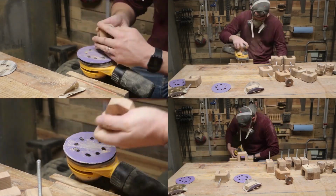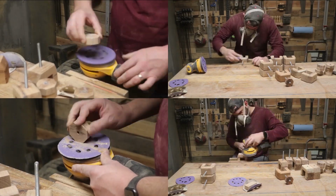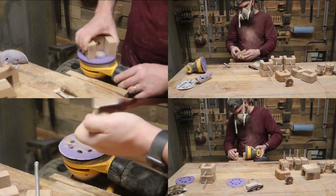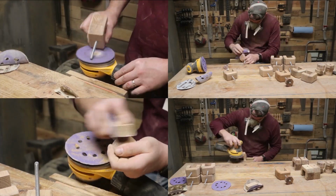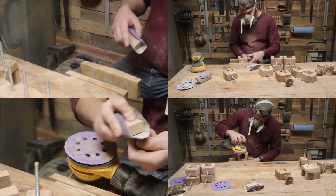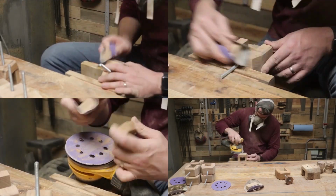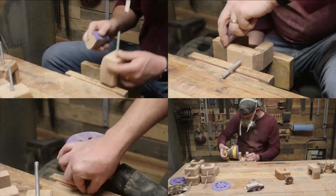I'm really regretting all the different surfaces and facets that I put in for all these pieces. And remember, I made 10 of these essentially. I'm only putting 8 on the rack to start with, but there's a lot of different flat surfaces that I have to sand and go through the 3 grits that I'm using. Starting at 80, then I'm going to 120, then I'm going to 220, and that's where I'm stopping.